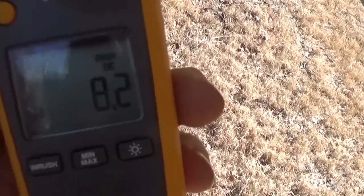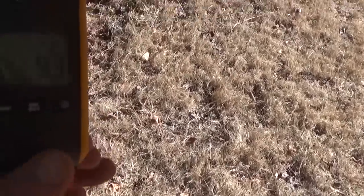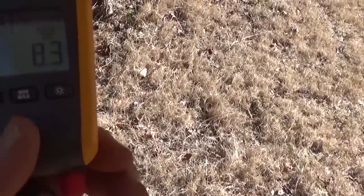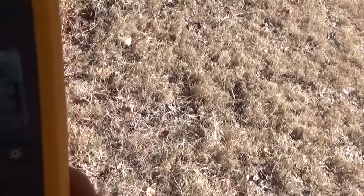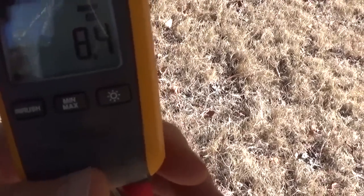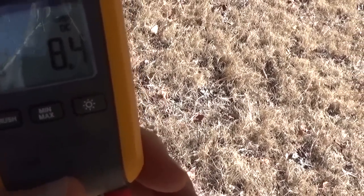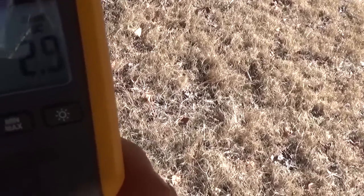Okay, a little shading testing here. We're in full sun — the solar panel is reading 8.3, 8.2 amps. The charge controller kicked off but we're back up to 8.4 amps. Let's do the shading test quickly while the pump is running so maximum power is flowing from the panel. We're just gonna shade one of the cells.